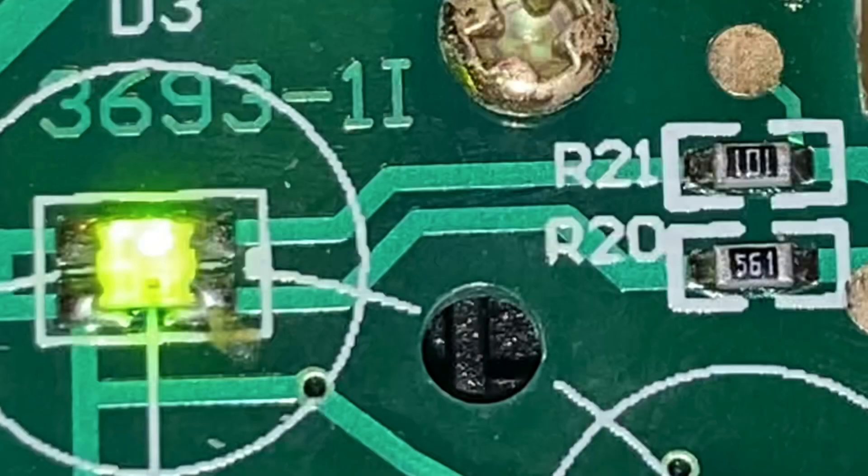On any iDog, all LEDs on the circuit board are connected to a resistor. These resistors had to be added because by default the red LED is actually brighter than the green. Without resistors, the lights wouldn't be able to create the wavelengths for yellow or orange — the red would just completely overpower the green. The resistors suppress the brightness of the red LED so the two can blend to make yellow and orange.